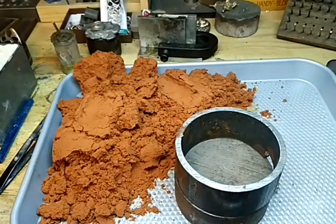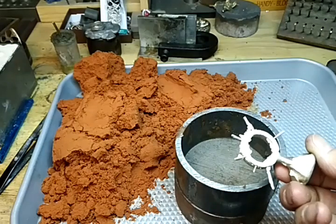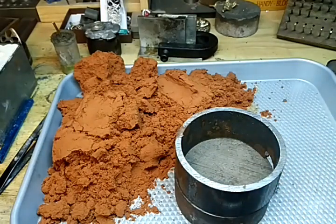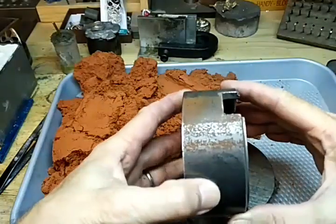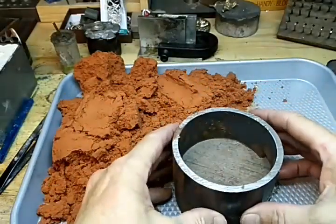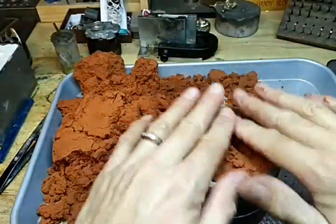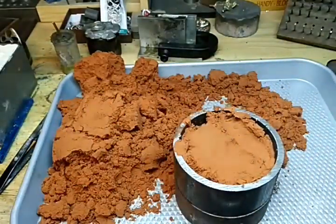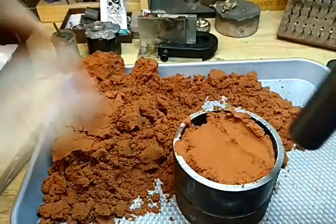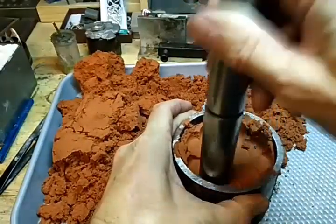I need a pretty big piece of stock in order to make this band, so I need to fabricate it. My ingot mold is too short, so I'm going to take this — the side with the rim on it — put that down. I'm using just petrobond, no Delft, just the petrobond. I'm raising my lamp here and using the end of a mandrel to pound this down.